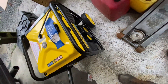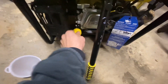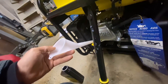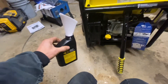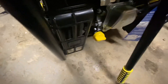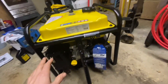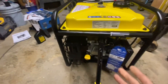We'll take it in the barn and get it set up. That's your dipstick for your oil — you'll pull that out. This funnel comes with it, sets in there like that. You can put pretty much the whole contents of the included oil in there, just check your dipstick — you might overfill it a little bit, they send you more than enough oil. The first thing you do: don't be putting gas in it or trying to start it, because with no oil you'll burn it up.